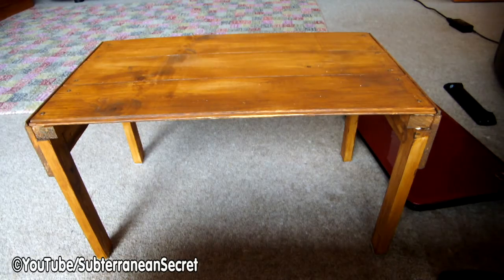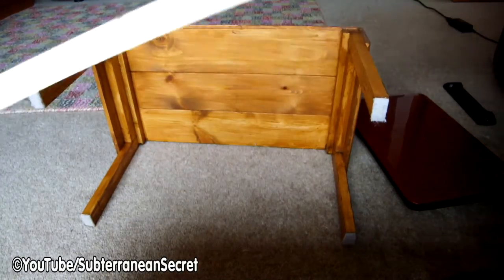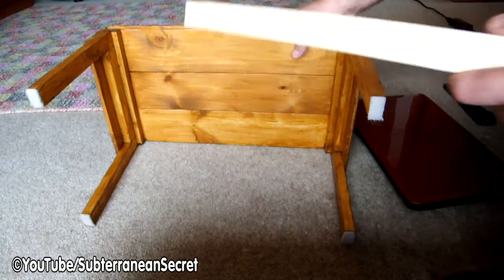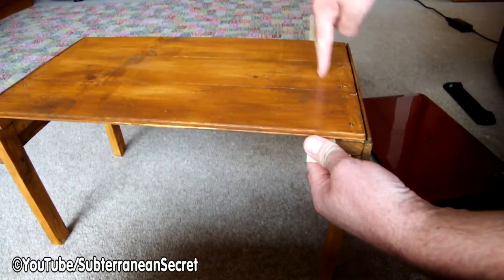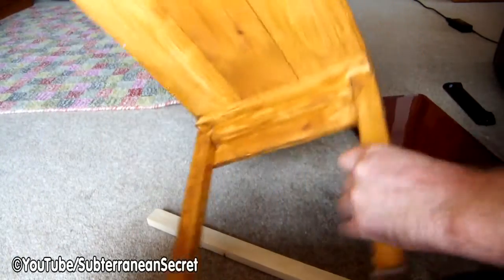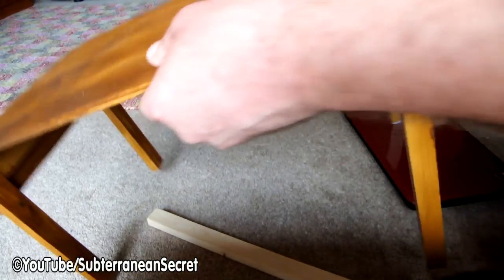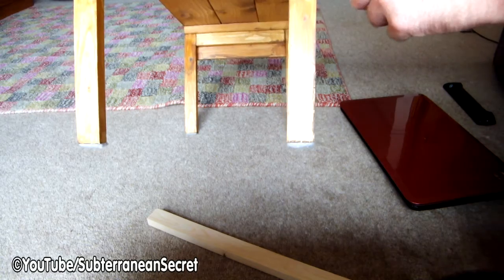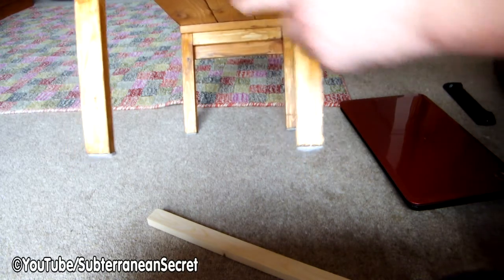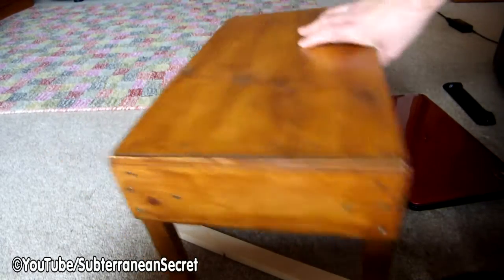In terms of construction, it's simply a case of using this kind of piece of wood for the legs, with a piece across the bottom. You screw into them. I've used another piece here to give it added strength. I've used wood glue on this but you don't have to — just use more screws. For the legs, just two screws. I wouldn't glue these on because then you can remove and adjust them for height or shorten them.